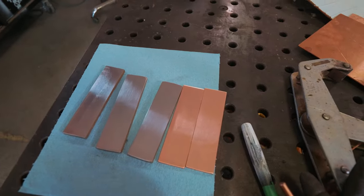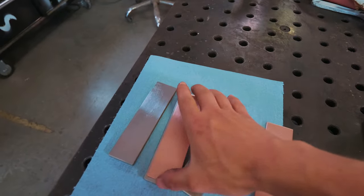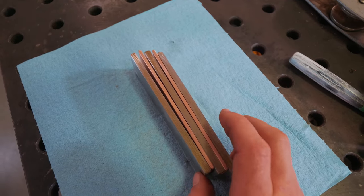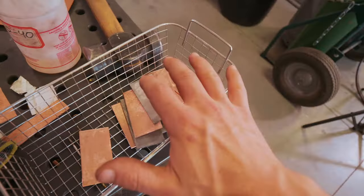So I'm about to make my stack with just regular steel. Sam has got his material ready. We're going to go: steel, copper, steel, copper, steel. He's going to wrap around the seams so that we hold it all together. I'll do much the same with mine. Since mine is the considerably cheaper and easier to replicate one, we'll start by trying to forge weld mine.